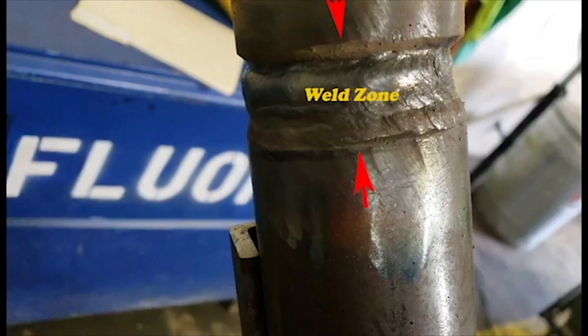It's all in your preference. The QC is looking for quality. You want to show that you can weld without a bunch of undercut and so on. They don't want you to go too far out of the weld zone, but five stringers — hey, it's no problem. You're not too far out of the weld zone. Everything will work out well.